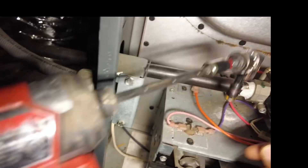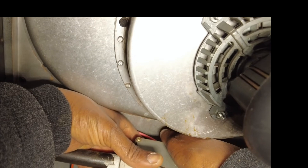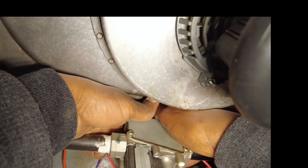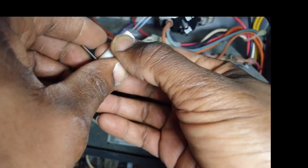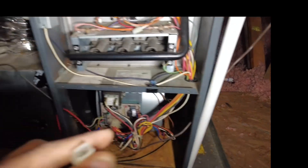I'm going to use my little extension slash 45 to go ahead and access the nut on the hot surface igniter — there she goes. It's weird how these things fail, because they don't fail out due to resistance necessarily. They could, but as you can see it's still running. Let's see how white this has gotten. If we ohm this out, I'm sure it'll ohm within tolerances — around 45 to 50 ohms.